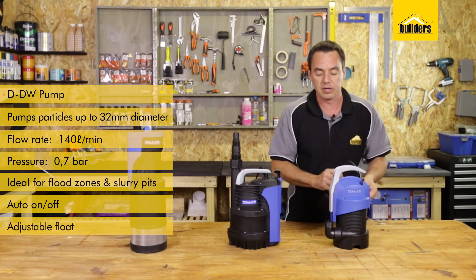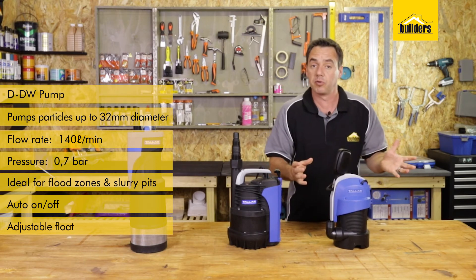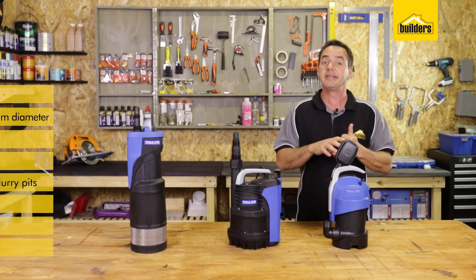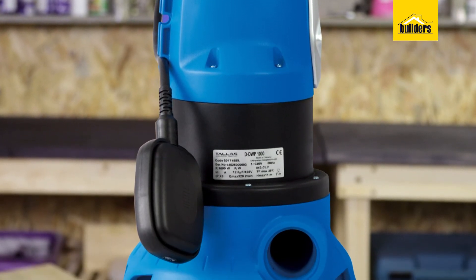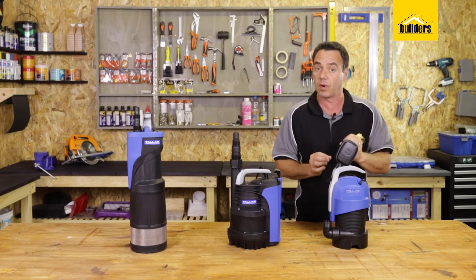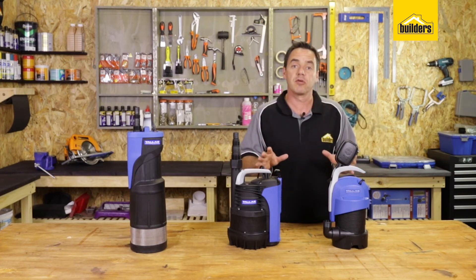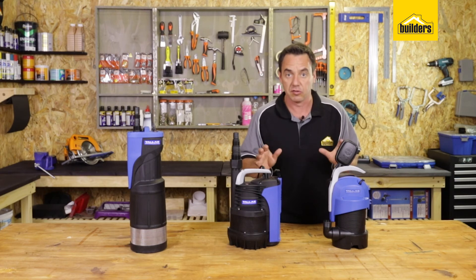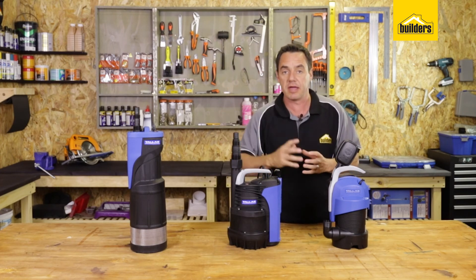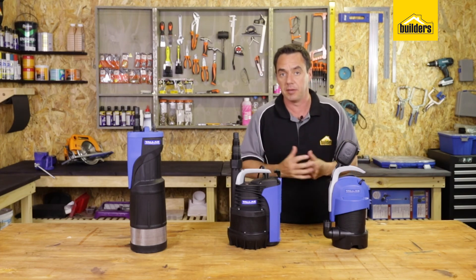You can adjust the height or leave it in manual mode by holding the float up to the top for it to be permanently on. It's a low power consumption of 210 watts. It also has a big brother pump, the DWP pump, which is 750 watts and pumps up to 320 liters a minute at 1.1 bar, and can handle a particle size of 38 millimeters. Both of these pumps are designed for 24 hour constant use — if you're pumping from a stream to another tank, they can run permanently. Because they're submerged in water they also keep themselves cool.